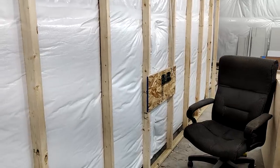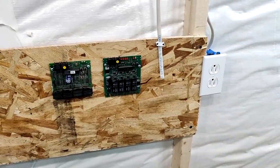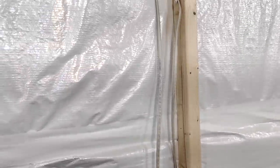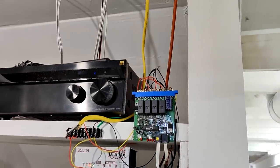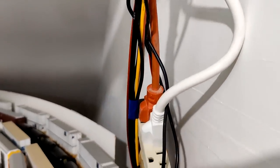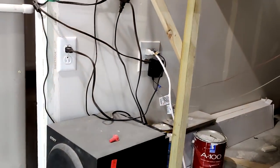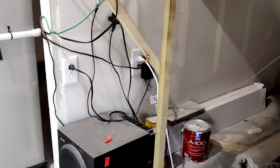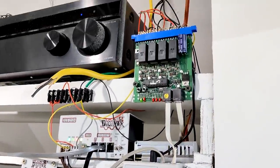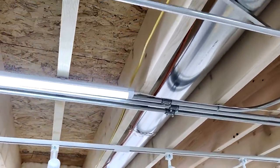As you can see, I do have the framing done already. I put up a board for a PM4 Power Management 4 by Digitrax and also a BDL168. I had to run the power from the main command station. This orange plug there is the power, and all of these are connected to the outlet on the right with four plugs — that's the train outlet powered through a switch so I can turn everything on and off. These two cables — I don't have the yellow hooked up yet, but that's a 12-gauge wire — are going to be the A and B power running all the way to a new power manager.